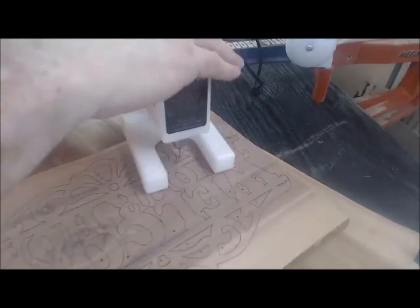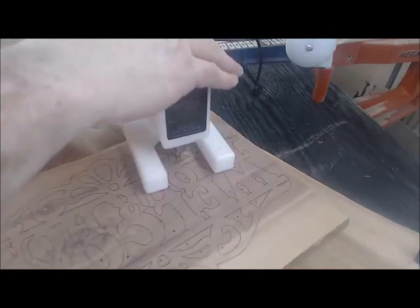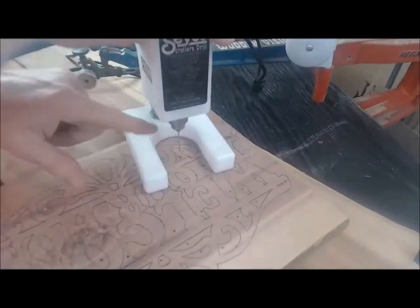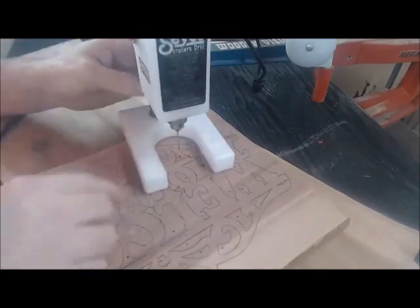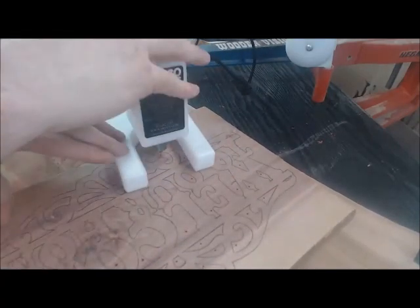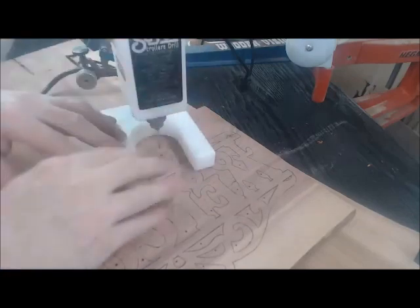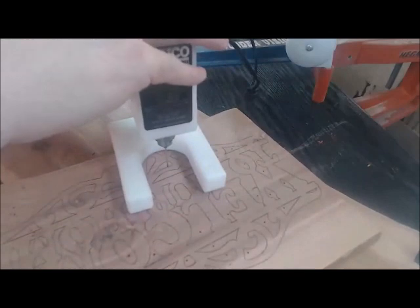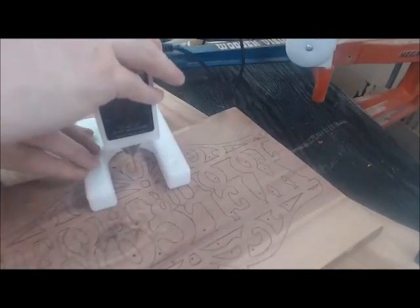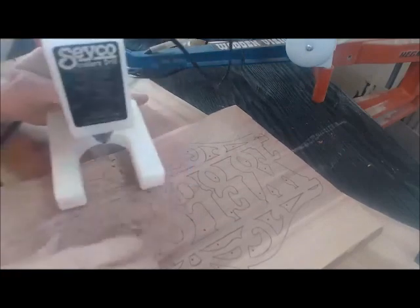Because I usually use a drill press or a big hand drill, I wouldn't mind a little more torque here, but it hasn't bound up yet — I keep watching that chuck to see if it slows down. You obviously want to make sure you're on a level surface and that the material you're plunging into is level, because that's what guarantees the 90 degrees if you're going for that.